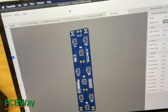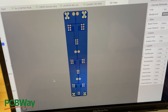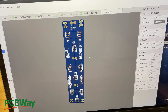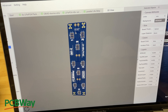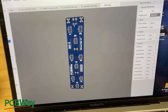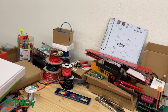See that one there - that is the little power strip. It's got nine slots and it connects them in series: three in series, and then parallel to each other. So three sets of three in series, then parallel. This allows you to make these weirdly arranged batteries of 5S lithium iron phosphate - 16 volts - into 48 volts. 15S lithium iron phosphate works out to be a pretty legit and very common 48 volts.